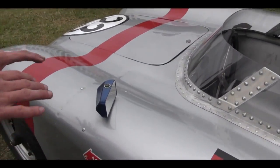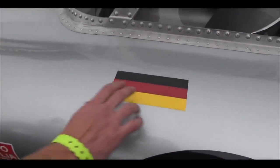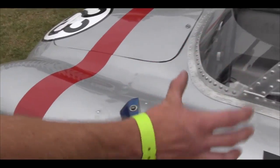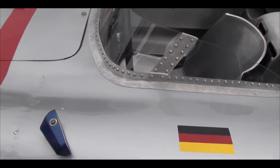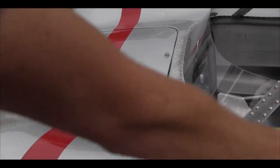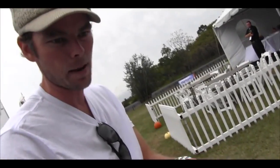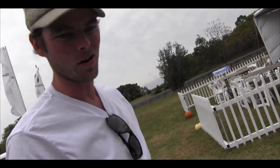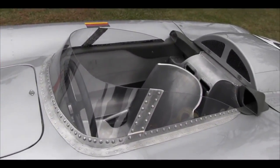It's really hard to see, but there's actually a high point in this side panel right in here. So this panel had to be blistered up on the English wheel. I had to cut this section and blister it up. And then I butt welded most of this up in here. And in some areas, I lap welded it, overlapped it, and then bead rolled it to give it more strength. Again, I didn't know how to do any of this. I didn't even really know how to weld when I started, so it was a real steep learning curve.